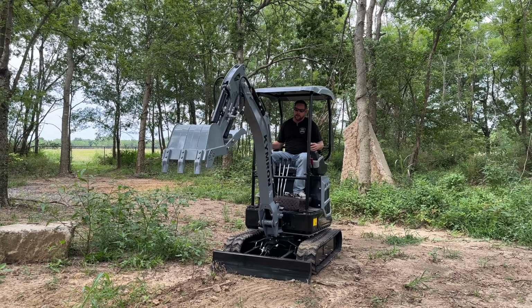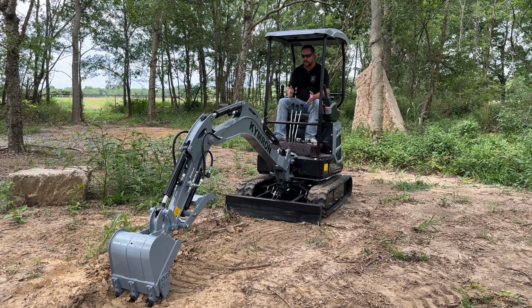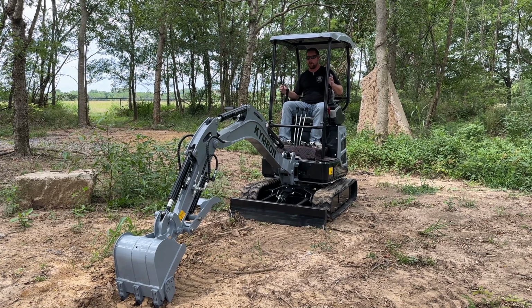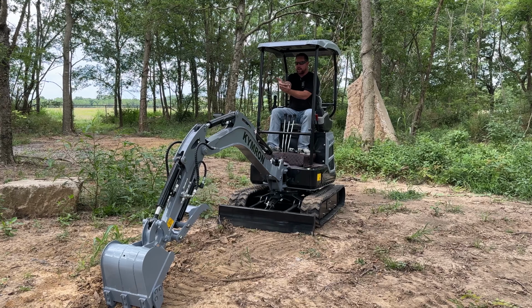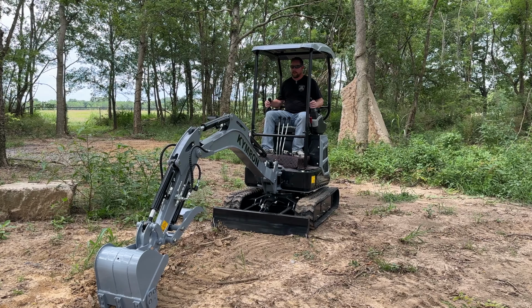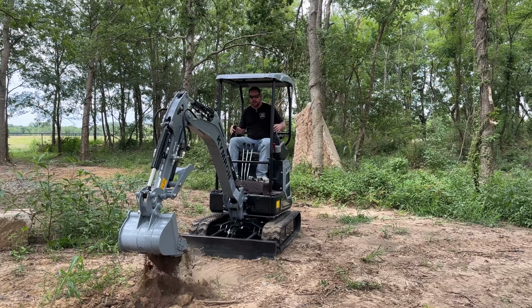All right. And in this video, I'm gonna kind of dumb things down a little bit, and we're gonna just go over the fundamentals of digging as well, because we don't ever do that. I just always take off digging and everything. So when you're digging dirt, you're basically cutting earth. Your bucket's coming in and it's cutting like you're slicing layers off. So that's what I'm gonna demonstrate here: we're gonna come in, make our cut, and then immediately curl the bucket here. Then we come forward and take a slice out, just like that. So there you go.